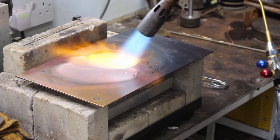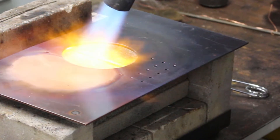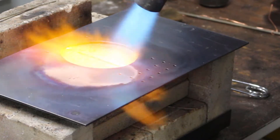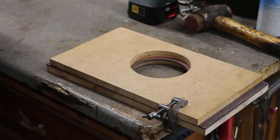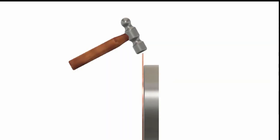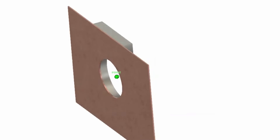The first job now is to anneal the copper. In part two of the series when I was making the tube plate I had to shrink the larger diameter down to the smaller diameter. This was done by working from the edge of the blank and gradually bringing it down to the former diameter, then working towards the bend location to flatten it out. In the case of the throat plate I have to work from a smaller diameter up to a larger diameter, stretching the material.